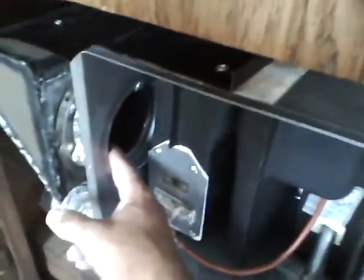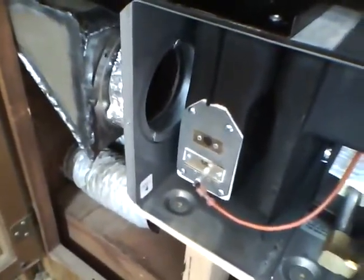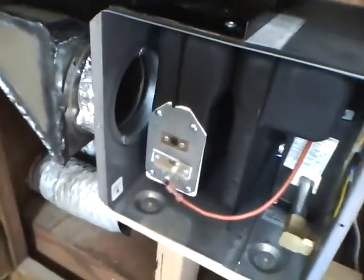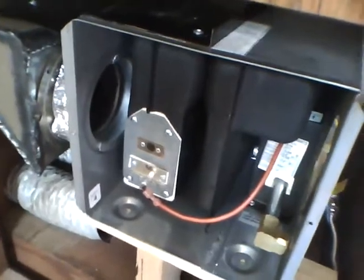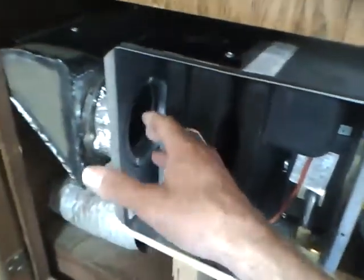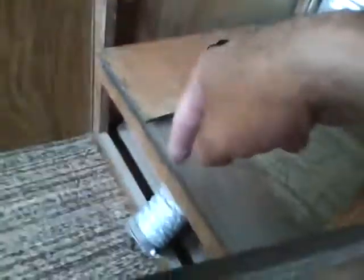This one over here is a 4-inch duct feeding into two 3-inch ducts. So that's what I was worried about. I did some math and it comes out to be 26.5 square inches total. Problem is, this is going through a little bit of a restriction, a deflector. Some of the air is going to end up coming out by the fridge here, and some of it's going to go up front up there.